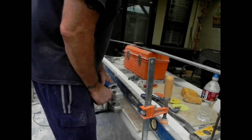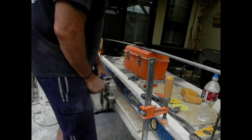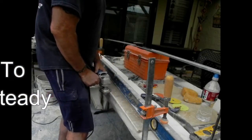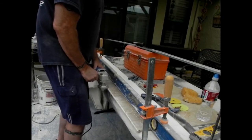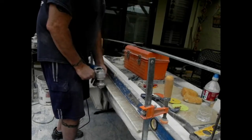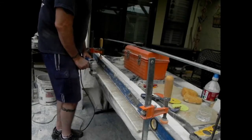I've got this rig going on a picnic table. Go slow and steady — if you've never done this before, watch this video a couple of times. The main thing when you're bullnosing is to have a flat surface and use your whole body with the Blaster, keep it steady. Try to clamp this down as best as possible. I'm using my six-foot level and some clamps. The main thing is I've got a piece of wood on the back so these pieces don't slide backwards.